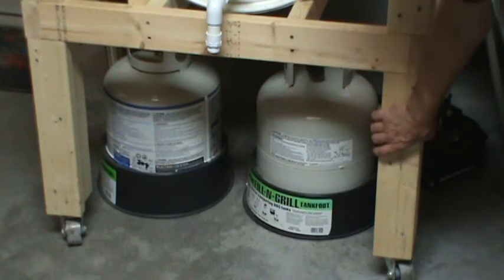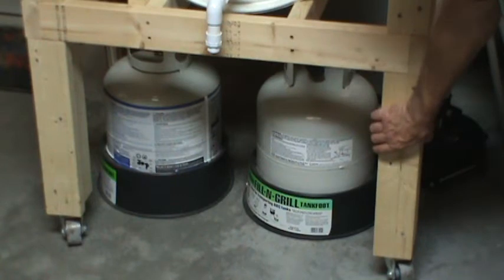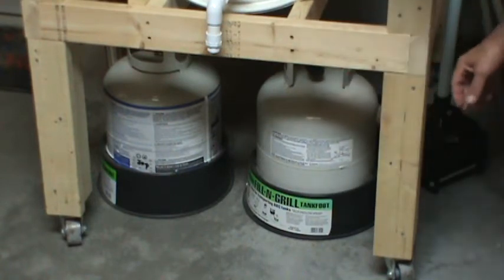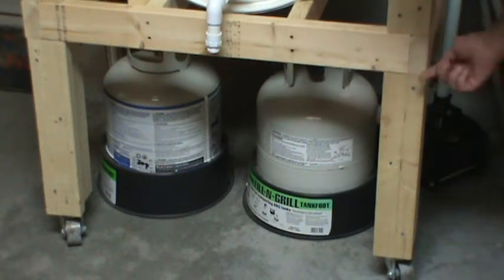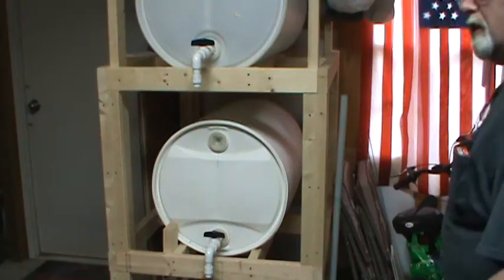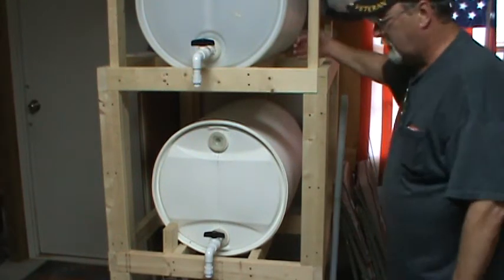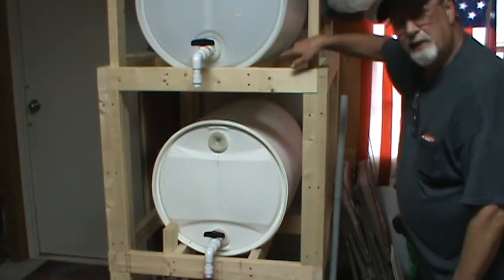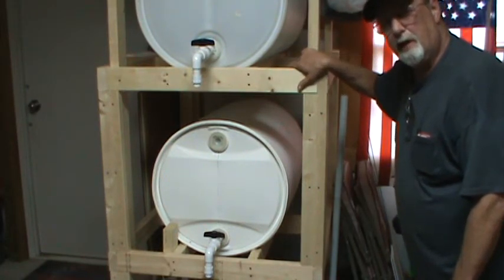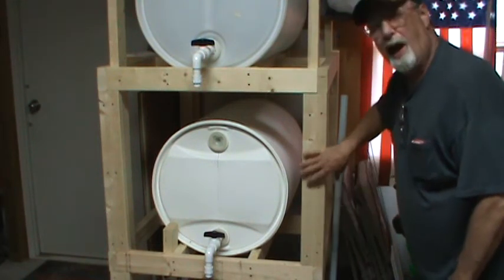The reason that these are put on is because they're weight bearing. When you've got the shelf sitting on these, it transfers the weight here instead of just putting screws in through the legs themselves. As you see in the earlier video when I was installing the legs in the platform, these 2x4 legs are on the inside of the platform, not on the outside. The reason I put them on the inside was so that I could put the weight-bearing 2x4s on the outside.